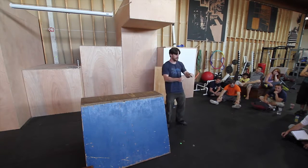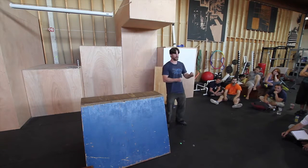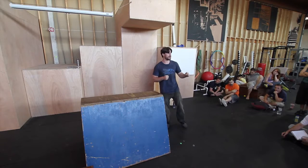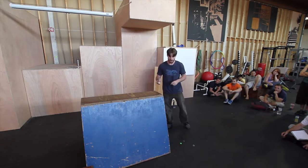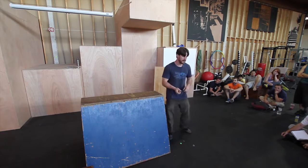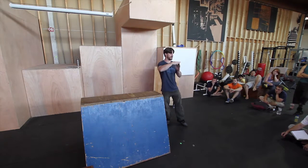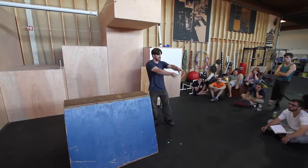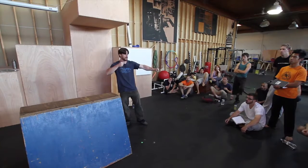If you take that same piece of wood and you put a piece of plywood on it, and you put in a bunch of screws, like a screw every 6 inches, or a nail or whatever, and you try to pull it apart, you will not be able to pull it apart, for sure, even if you're using fairly thin plywood. The reason is that you have really weak shear forces when you're just using your framing members. They're only kind of good in some directions. The pulling apart direction doesn't work very well. The shear force as you're pulling things apart doesn't work very well.